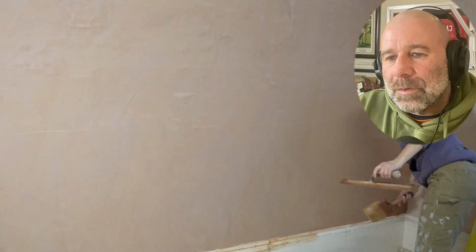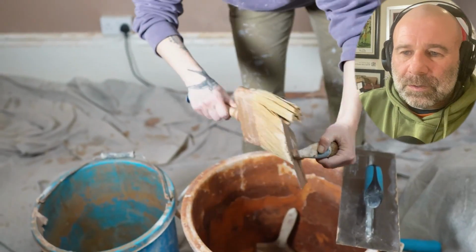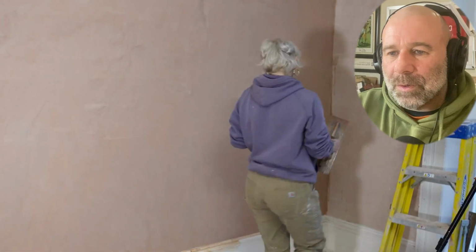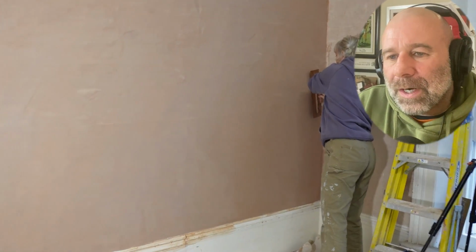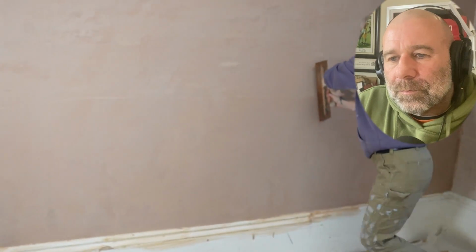You probably just go underneath what you've done. You don't have to use all the trowel. You don't have to do water every time. She needs to go back a bit, it's killing me just going one way all the time. In the same spot or lower? Underneath, yeah, go lower. So every time you do it, go lower and lower, just so your trowel's following out the width. You basically try and trowel out the watermarks that you left. That's it. It's a lot better.